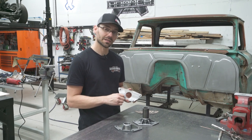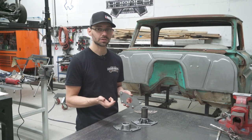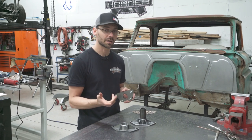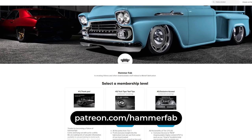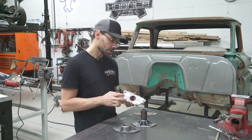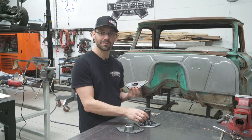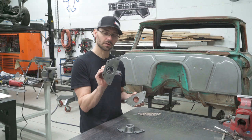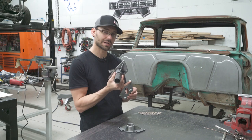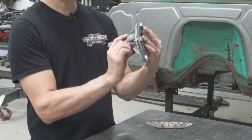I did a little video on how to power tap the other day. If you guys are one of our Patreon followers, you're going to get exclusive access to that content — go sign up at patreon.com/hammerfab. I've got some bolts threaded into that piece right now just to show you how nice the fit is on the other mating part. These holes are also laser cut — a little bit bigger for the outside diameter of the bolt. See how snug that is? That's a perfect fit.